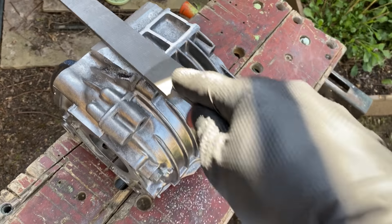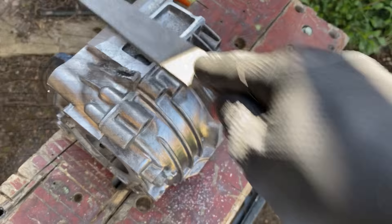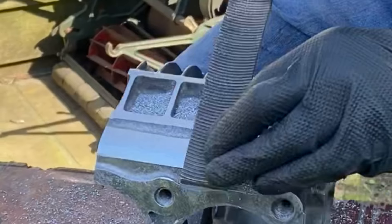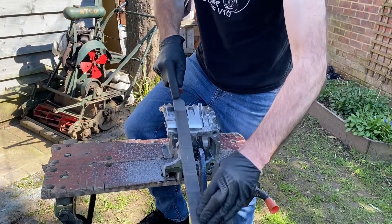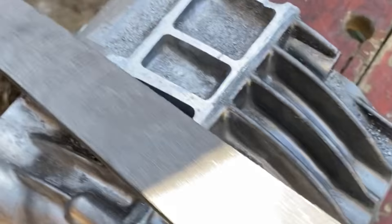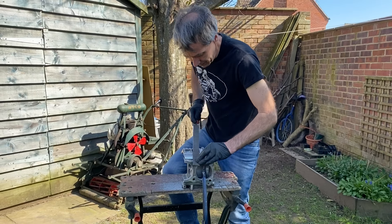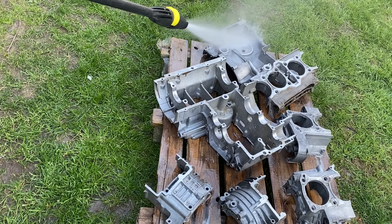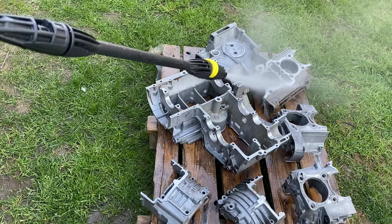With the crankcases cleaned up, the next thing I needed to do was file down some bits of old engine mounting bracket I no longer needed. The best way to do this is with my coarse aluminium finishing file, using my workmate and an old G clamp to hold it in place. With all the filing and machining complete it's time to give them a good wash with a jet wash — this gets all the swarf out of everywhere and once they've been dried off they're perfect for welding.